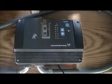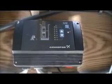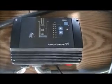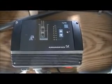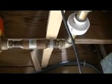This is a Grundfos variable frequency control. It varies the speed of the pump to regulate pressure at the pressure you desire. I've selected 50 psi for this system, and with the two flow regulators shown here and here, the large unit is regulated to about 10 psi. It's running, I tested it at 12 gallons per minute, not psi. The 3-ton unit is the other unit, and it runs at about 7 gallons per minute.